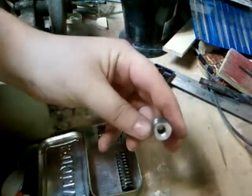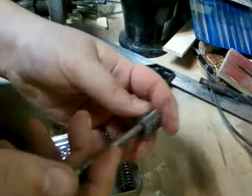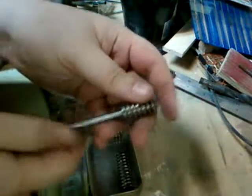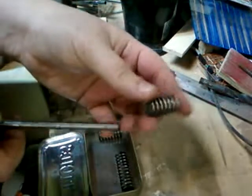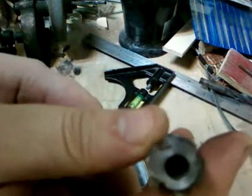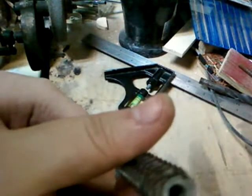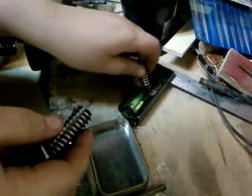I took them out on the lathe and drilled a hole through them and faced the ends so they're flat. Now it's right for this bar, which I'll use — I'll turn down for the hob. I took the angle grinder and went sideways so it has cutting teeth. I'll clean it up with a needle file — I've got a triangle file I'll clean it up with.